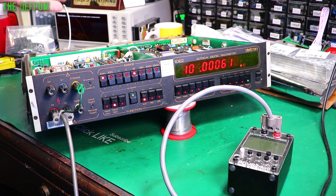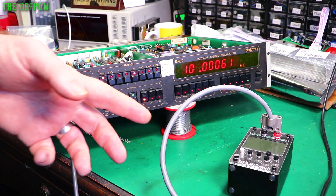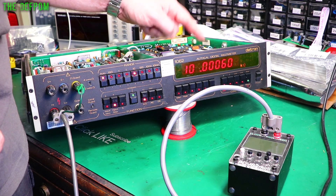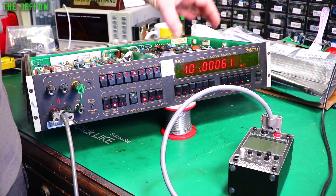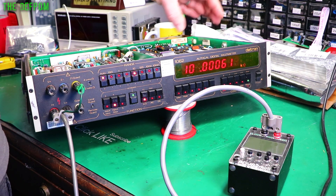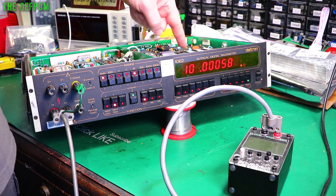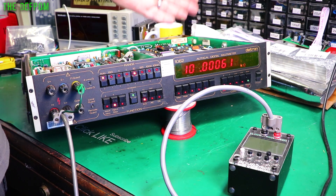I think I'm going to call the video quits now and cut it off here and say this is done. If there's anything else that comes up I'll leave it at that. What I will be doing though is the EEPROMs on here - these aren't online, these values. So it's the 2-9-0-0-5-6/A20, dated 8th of July 87, and 2-9-0-0-5-7/A20, and 2-9-0-1-1-3/A20. These EEPROMs aren't online, at least not that I've found. So I'm going to read these EEPROMs, put them somewhere and share them around, make them available to people. If you need these EEPROMs, at least there's a copy somewhere - right now there isn't one that I can find. I'll do the same for the EEPROM on the GPIB board as well, the IEEE interface. These are the 27C32 versions, not the 2532s which are in the earlier units. So this is a later version, a bit more important that these are out there.